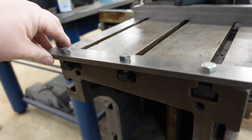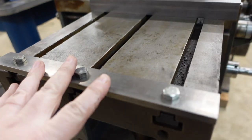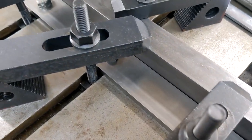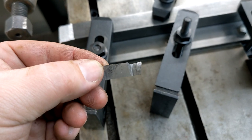I made a kind of backstop which clamped directly to the T-nuts to brace the part from behind. That seemed to work. I still want to get a real vise for it, of course, but at least I can get some practice on the thing in the meantime. After a bunch of iterations of tool shape and orientation, I started to get some halfway decent results with a roughing cutter.